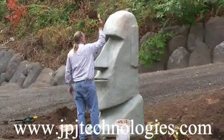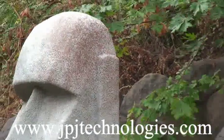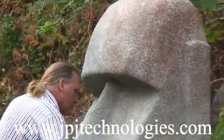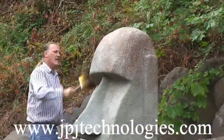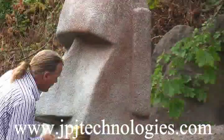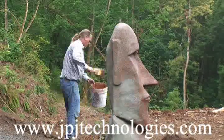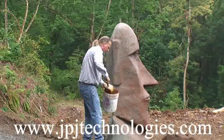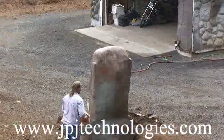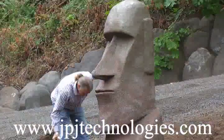The compressor — I don't have a compressor in my shop right now, just a little teeny one. Using an HVLP gun to spray this on would have been my preference, but not having enough CFM to do that, I just use the pool deck brush, which is an old technology we used to stain this way. For as little as I'm staining here, it doesn't take very long. I don't really address the staining in this short clip — I edited out a lot of it because of YouTube video time — but we have staining covered in our other DVDs.